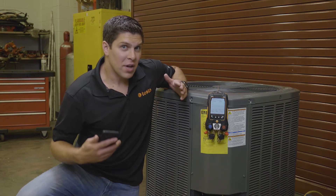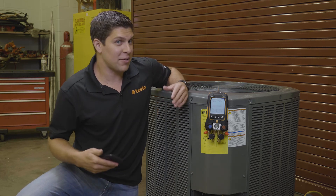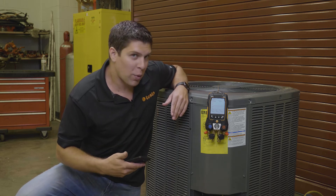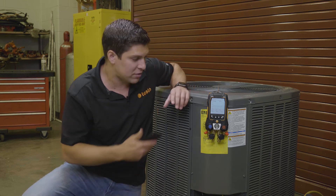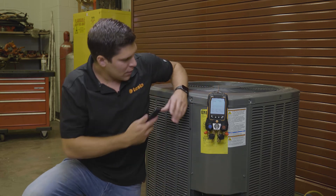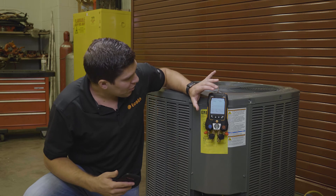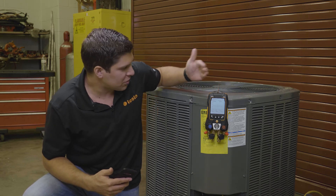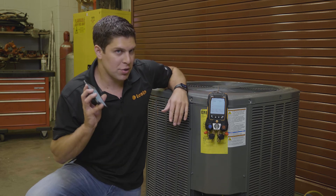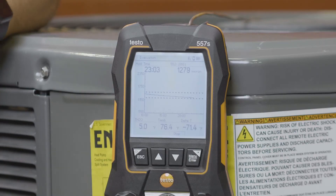As all techs know, it depends on the vacuum pump and your hoses — this took a little bit of time. It could take an hour, six hours, or worst case a day. We've already adjusted the parameters to about 1,250 microns. I'm going to go ahead and close off our pump and shut it off. You're going to notice your microns jump up a little bit. With the graphical display, you can see the sweep — we want to wait about 10 minutes, but for the demonstration we're holding real tight. You'll see within the graph that the sweep goes up a little bit and then flattens out, which means we've got a successful vacuum at whatever target you set.